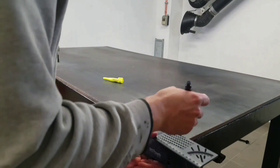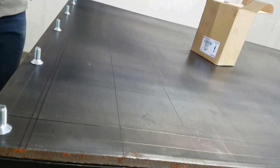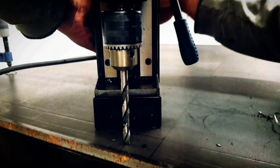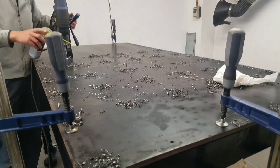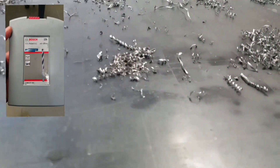That's it — the first hole in my plate is done. I'm sorry to put a nice plate like that through this, but it's necessary to fix things. The plate is 12mm thick, but with a magnet and a good drill bit it goes very well. I've done all my holes without needing to resharpen the bit once. I lubricated it, but the drill bits are really not bad at all.